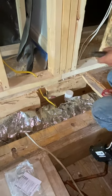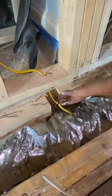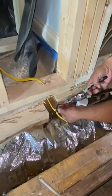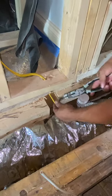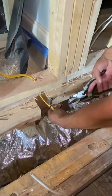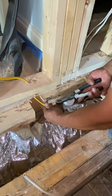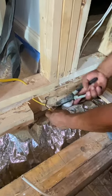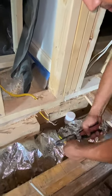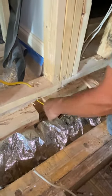This will shock you and you will have problems. I'm going to undo this. See, this is something we don't do — somebody spliced the wire trying to get away with that, but this is not safe. Don't do it. If you don't know, don't splice it and try to hide it, because down the road you're going to have problems and you'll never find the source. I'm going to undo it and cut here.